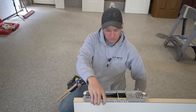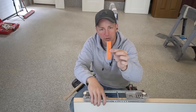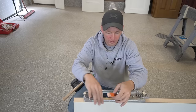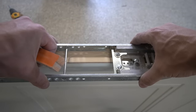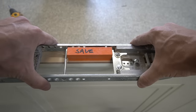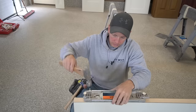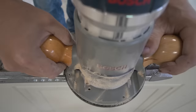So what I did is made a jig at the bottom — it's two pieces of wood: the bottom is three and a half inches, the top is three and five-eighths. I can drop this piece of wood into place, and since the bottom is three and a half inches, I can line that up perfectly with my pencil lines, tap my nails in, and that'll be exactly where I need it. Ready to route.